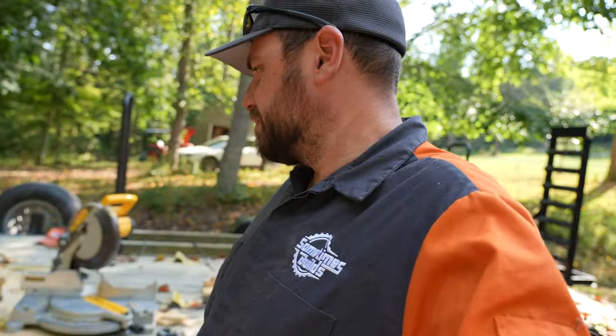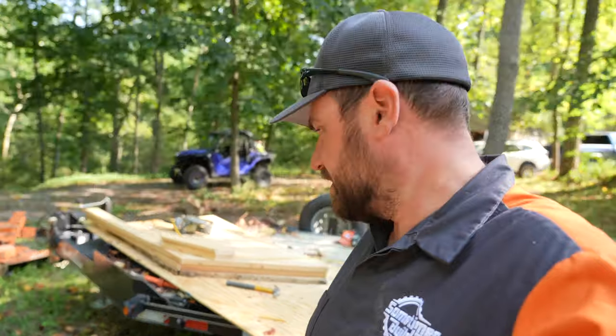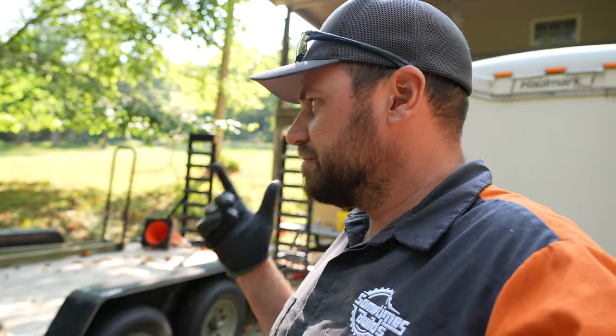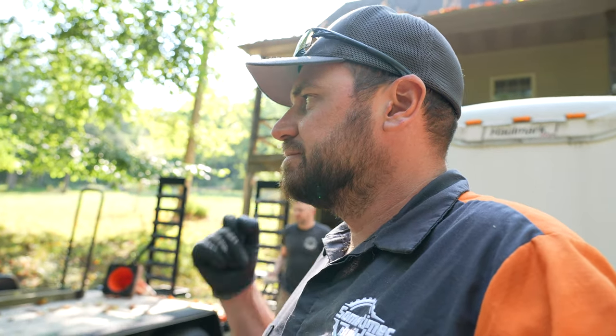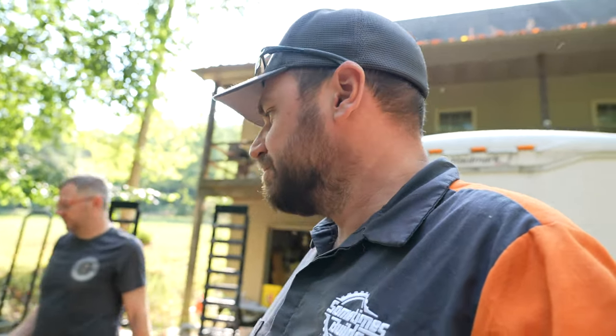So, the wizard with wood did all that stuff. We have replacement joists, he's getting screws, drill. We replaced those two joists. And we have the one giant piece of plywood up there, the full sheet. And then we have to measure and get all this little one. And then that's it. We're not going to put the shingles on or whatever. We're just going to tarp it, and that'll be a part two. Shingling.